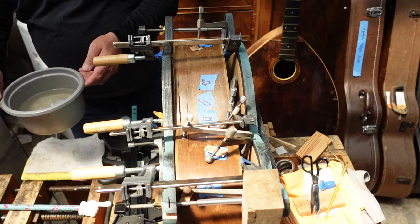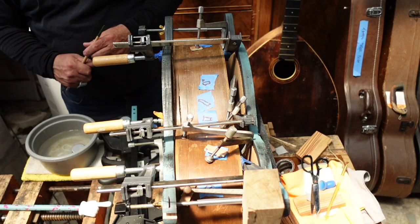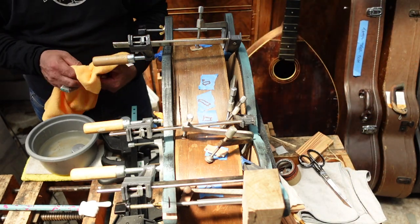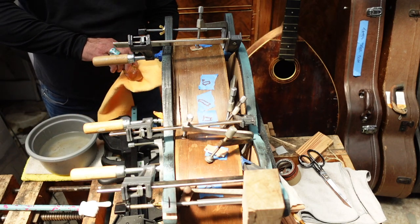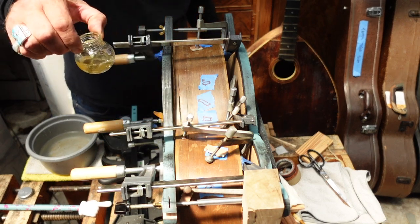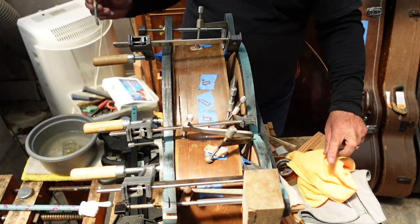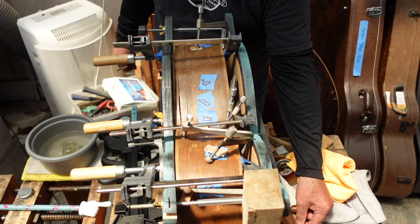Okay, I'm going to bring the glue pot that's still hot. This is why we use the edges of our fingers. And we have a rag going, and that hot water is there for us. We'll just open this up. And this has the consistency of sewing machine oil when it's nice and warm. And we're going to keep it nice and warm by leaving it in there. We always keep the stuff in the refrigerator when we're not using it because it will mold.